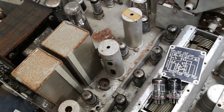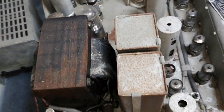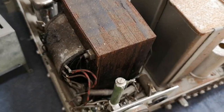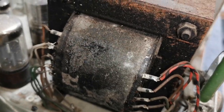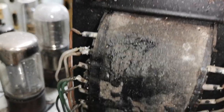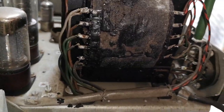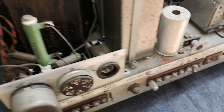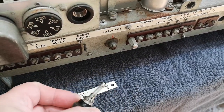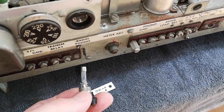And there's another thing that also stops this project, because we're not going to power this up. That is definitely out of the question. And now you see why. There was a fire inside this mains transformer. For some reason, I just pulled out the fuse. It's a 2-amp fuse. And of course, that one is exploded.